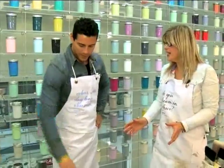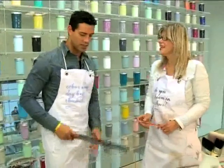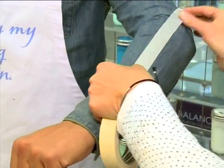We've finished measuring. Now we need to start masking. There is a trick: you need to de-tack the glue on the back of the masking tape — just get rid of the excess glue by de-tacking it. The reason is that walls are often not correctly primed, and when you pull the tape off to reveal your final ombre, you can end up seeing the primer or the raw plaster underneath all that intricate work, and you don't want to see that.